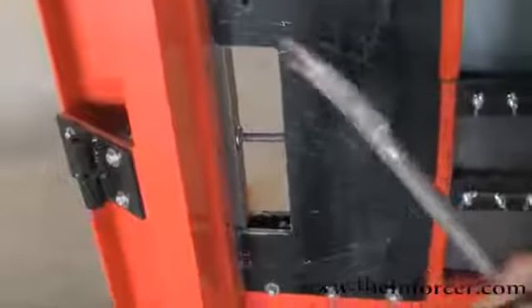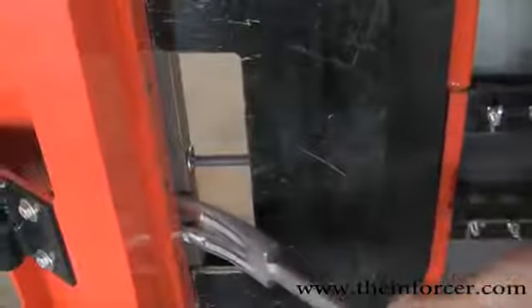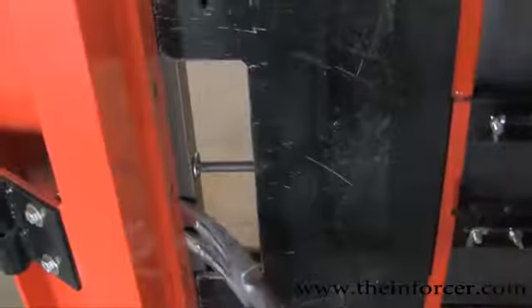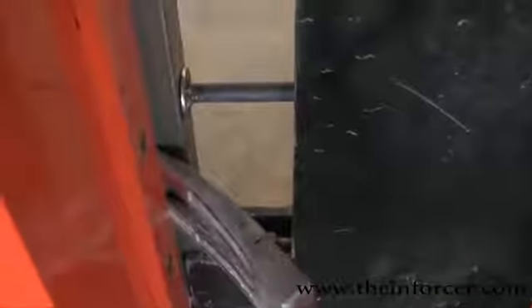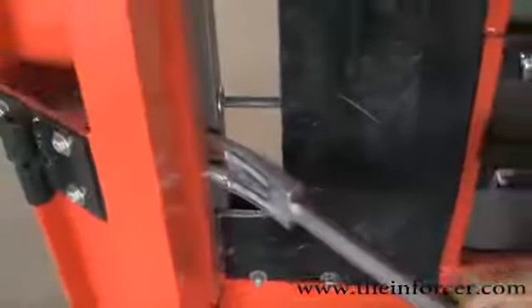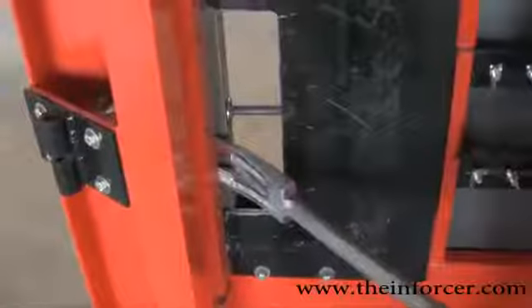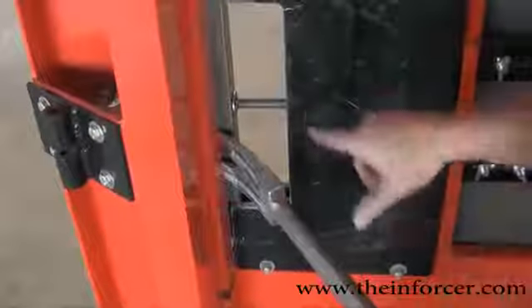Take this tool that's been — just a little bit of time with the grinder — stick it in that same spot, all of a sudden I can grab the edge of that door and feel that flex. When I feel that flex, that's when I want to ask for a hit from my striking firefighter. Without this, you're kind of flying blind. A lot of forcing an inward door is by feel — I want to feel that flex, ask for a hit.